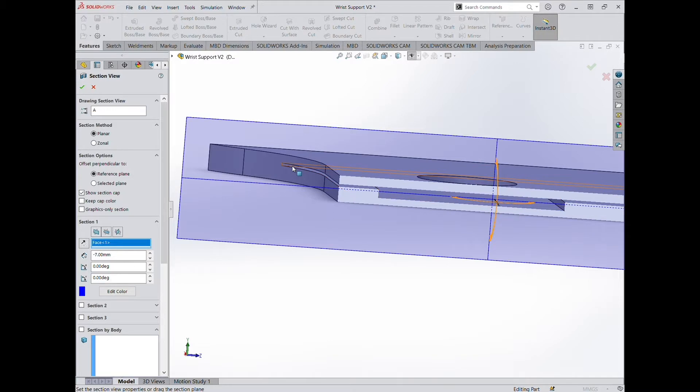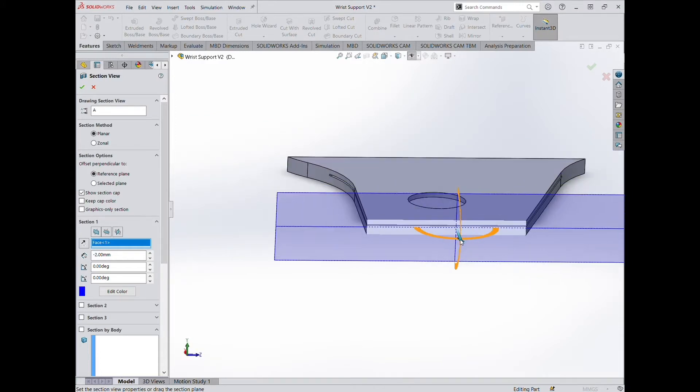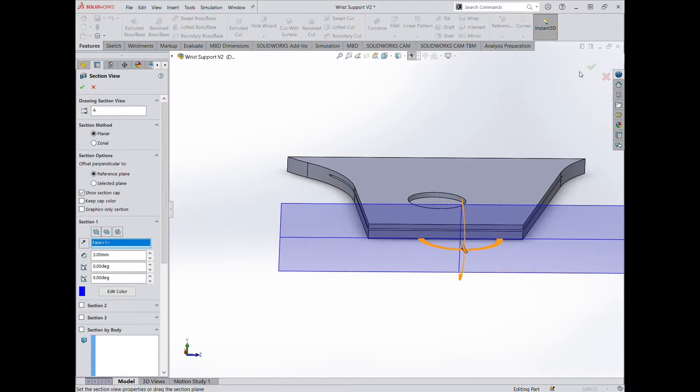The knob sticks up through this hole. I've given myself 0.2 millimeters — that's the layer height I'm using — so I'm hoping there's going to be one layer there that I can then insert my paper in that gap, and then hopefully this top part will print directly on top of that. Next I will hop over to my slicer and show you how I slice this.